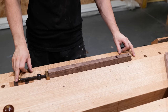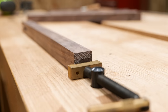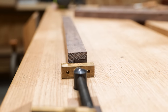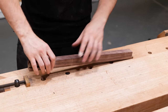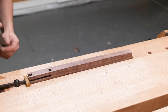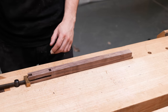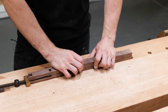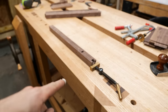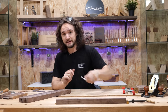All you need is a row of three-quarter inch holes — which for those of us using metric is 19mm. The only downside to this setup is the thickness of the block on the end; if you're going down any thinner there's a chance you could potentially hit the top of the dog with the plane. You can spin the leg around to have the thicker ends near the dog. Below about 22mm you're at risk of hitting the stem, so that's the limitation — but for a job like this it's more than capable. I'll pop a link in the description; this is what I used for years before building this workbench.